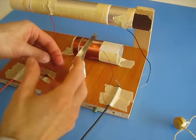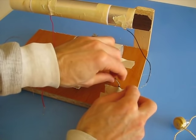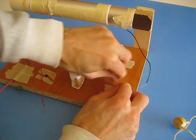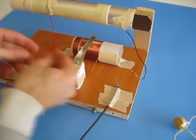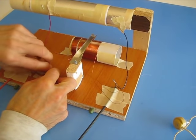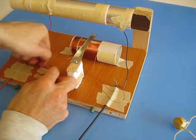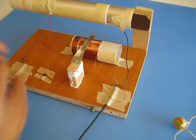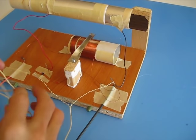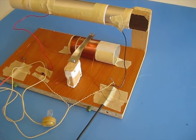I've done all four ends right here — all four pieces of enameled wire. Now to start putting it together. I'll start over here with the ground. Basically just follow the diagram — I just twist things on, fairly tightly with lots of turns. I like to put the enameled ones on first, the thin wire first, because the other wires then wrap around those tightly. I need to go from the wiper blade to ground as well, so I'll have to make a wire for that.